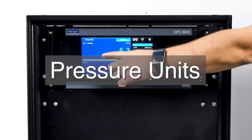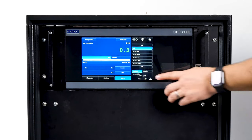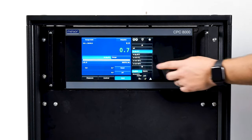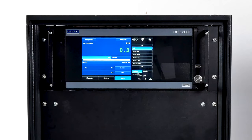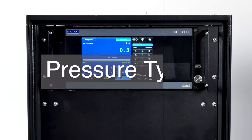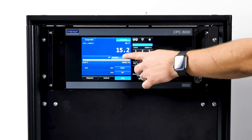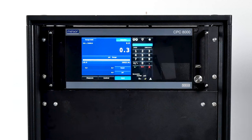These are the pressure units that your CPC-8000H is currently using. To change pressure units, touch the current unit symbol to display a page of the units menu in the sidebar. There are 40 predefined pressure units listed in seven menu pages, so it may be necessary to scroll through several pages. Touch either the up or down symbol to scroll to the next unit's page. The CPC-8000H has two pressure types, absolute or gauge, depending on what type of transducer is being used. If a barometer is installed, you'll be able to toggle this button between the two pressure types. The barometer is used to emulate gauge pressure when the native transducers are absolute, and absolute when the native transducers are gauge.